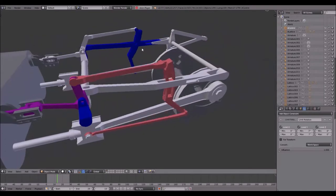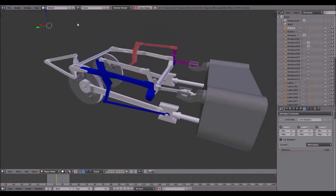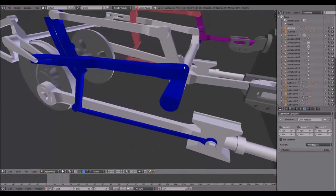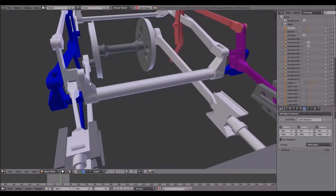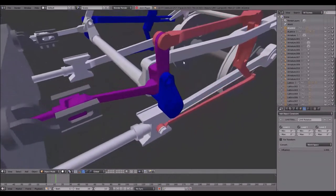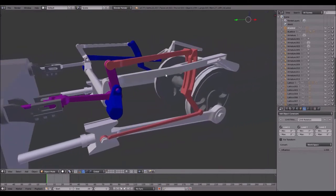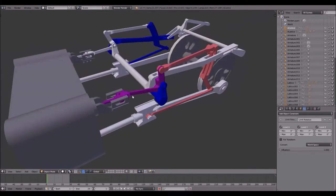Now for the blue part — it's basically the same again. The crosshead moves the link, and the radius rod is lowered in the link and now moves this rocking lever, which goes through this part. Basically those two parts are the same but the grey part is hollow here, and it moves the combination lever to create the necessary valve motion. You can see the valve is shifted from forward to reverse by the blue part. The entire valve motion is purple because the blue and red parts are combined into one motion.